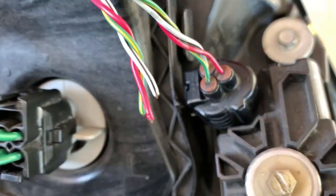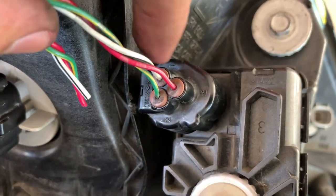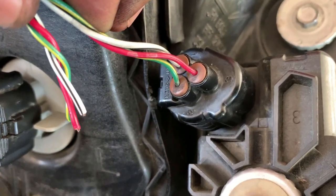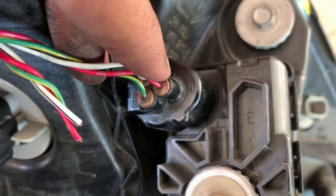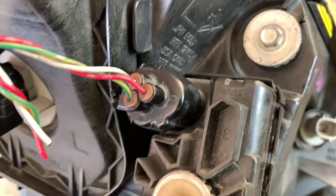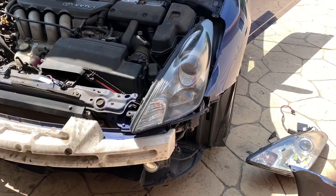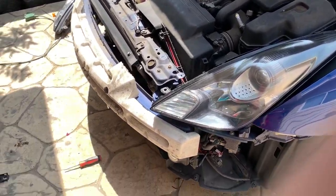Connect them to ground and power and it should light up. For your leveler, it's pretty easy - this connector is already color coordinated. Connector one on top is your ground, red is obviously your power, and the green one is your signal. Number one is your ground, number two is your signal, and number three is your power. Connect both grounds together, both powers together, and signals together. I'll show you the leveler switch when I put it on. I'm going to check if it works before I put everything together.